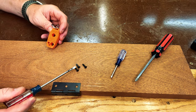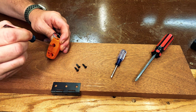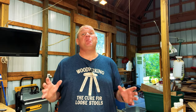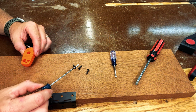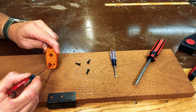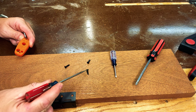So let's test this out and see if I can get one of my screwdrivers magnetized. Here's my first screwdriver — as I place it next to those screws, you can see there's no magnetization. However, when I place it into the top hole of this tool, just for a few seconds, pull it out — and now all of a sudden that tool is magnetized. That only took a couple of seconds. But let's test out the other function — demagnetization. Here I've got my freshly magnetized screwdriver, and now I'm going to place it into the demagnetized hole. And just like that, it's lost its magnetization. One thing you should know: you can't twist the shaft of the screwdriver as you're placing it into those holes — this will mess with the polarization and you won't get the results you want.